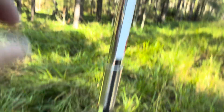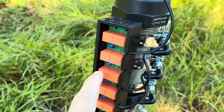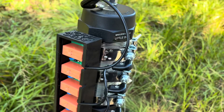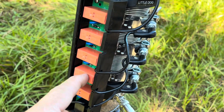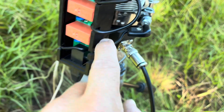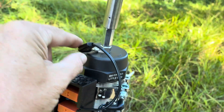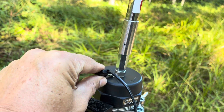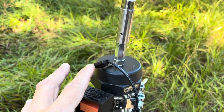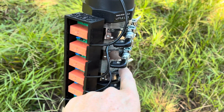I've got the bypass — the top one going to the bypass — with that whip tuned for 17 meters. The second one is not in. The third one I've got tuned for 20 meters. The second relay I've got tuned for 30 meters, and the first relay I've got tuned for 40 meters. If I had that tuned for 15 and the whip down a little bit to make it resonant on quarter wave 15, I would definitely lose the 40 meter band.